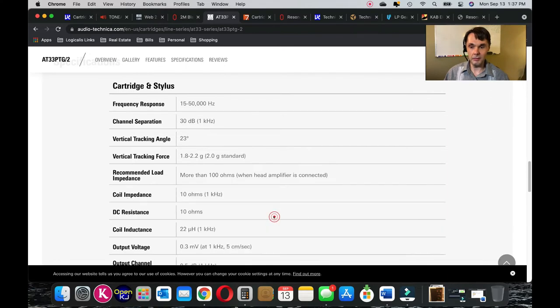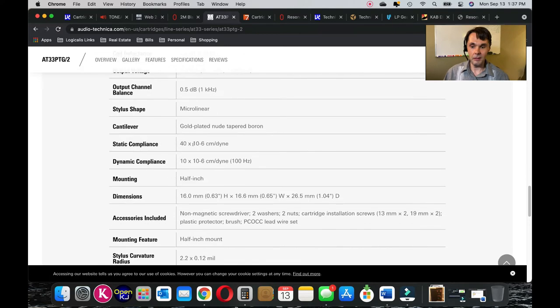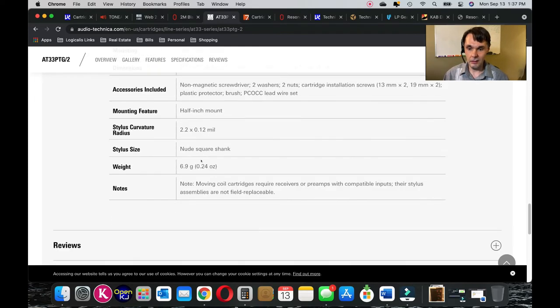So look, this is all they're showing us. No, we need to know more than that. Okay, so we're not paying attention to this for now, but dynamic compliance. Look at this. As promised, 100 hertz. So I take 10 and I multiply it by 1.5, and I get to about 15. Let's look down here. We also notice this cart's actually, even though it looks bigger, a little bit less mass, 0.3 grams, but when we're into this level of things, it's less mass than the 2M Black is. So let's go over here and plug in some of our numbers real quick.